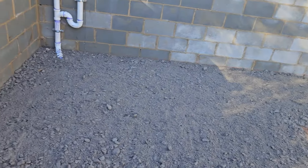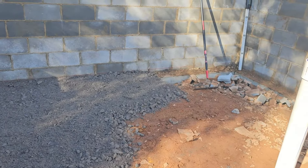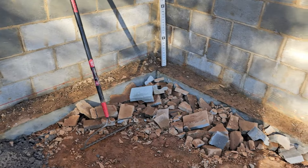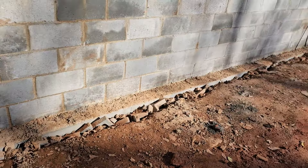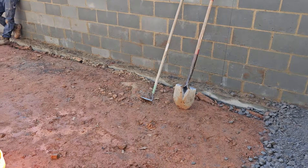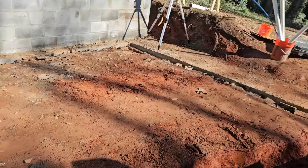Since we got our inspection, we started putting down this gravel here. You can kind of see it here — that line is the bottom of the concrete where the concrete slab will be, the top of the stone. So we're going to put that stone in all the way around here. And then we'll be putting down some plastic, and after we do the plastic, we will put down some mesh and be ready for concrete.